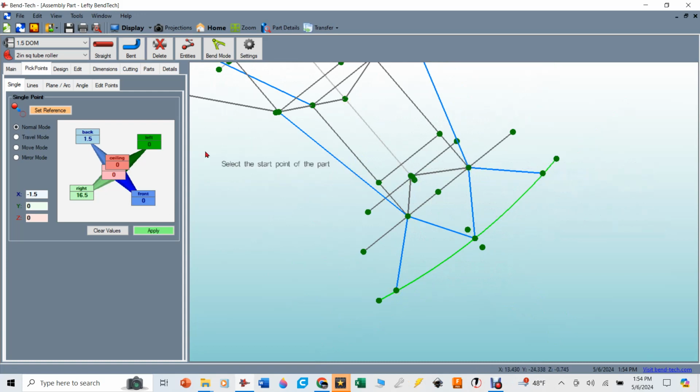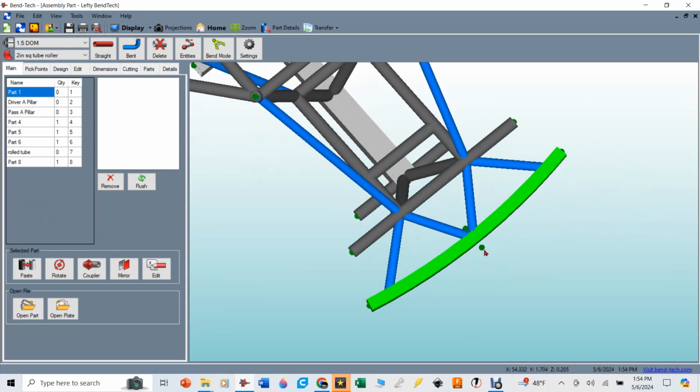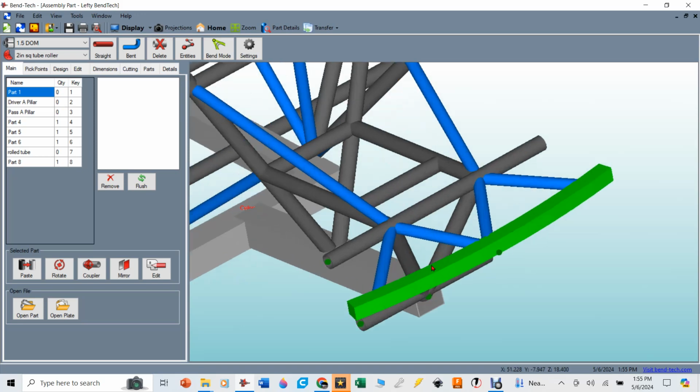And so when in doubt, make a triangle, and you can kind of see, at least in the lateral, that's going to be a pretty robust bumper there. I think if you hit it on any one of these sides, it shouldn't bend itself back into the tire or something like that. So remember, this tube actually extends along a little bit further than this, but putting the tube right here allows me to avoid where I'm going to mount the lights.